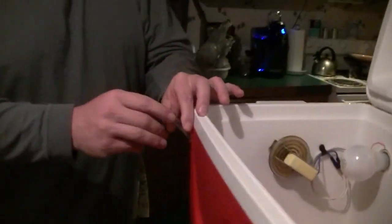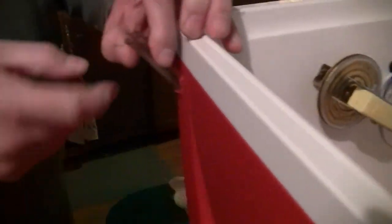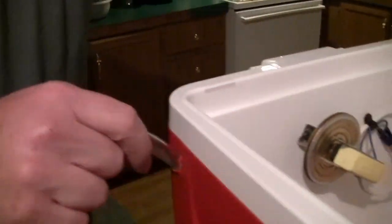See, the line is capped so that during incubation, this will run out of, or get close to running out of water within 60 days. And so you'll need to uncap it right here, take a regular kitchen funnel right there, and you can look inside your box here. While you're filling it up, you can look inside and see when your water reaches optimum level. And this is a convenience so that you do not have to open the box to add water.